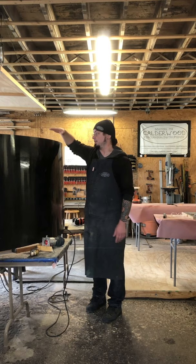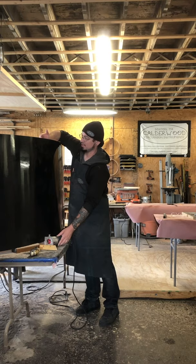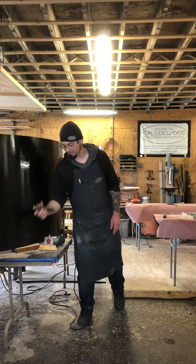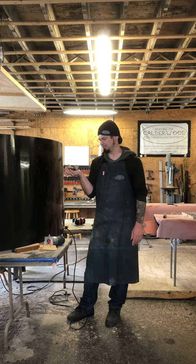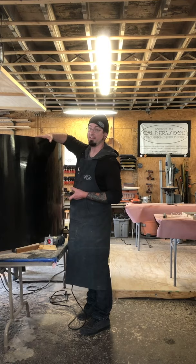So in order to get this flat to prep for bearing edge cutting, it was sort of a multi-step process. The first thing we did was use this trim router and ran it sideways against that bearing edge to get it sort of in the ballpark. And then mostly just using this block plane — this is a really nice little bench dog block plane that we got from Rockler, which if you're looking for a pretty kick-ass plane that is not wildly expensive, these are pretty awesome. It's a really useful tool as long as you keep it super sharp.